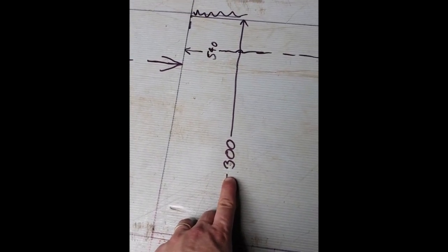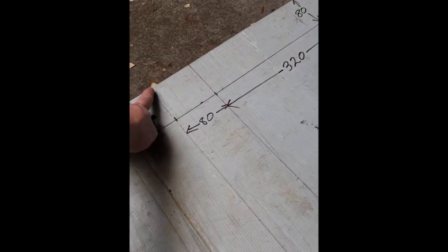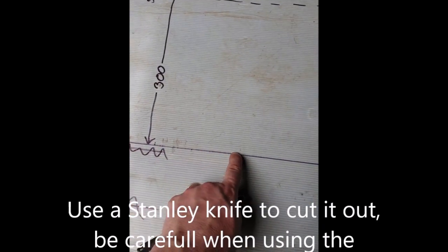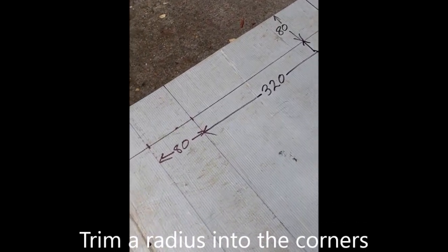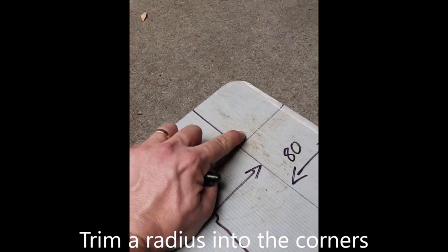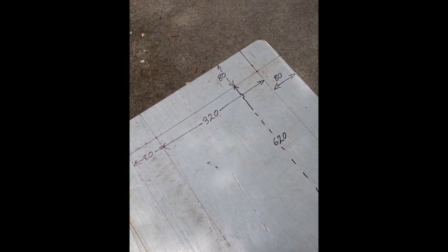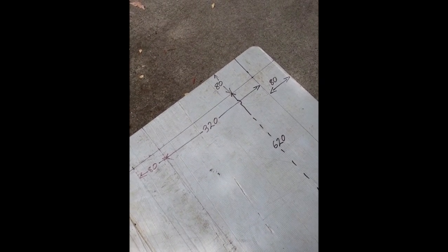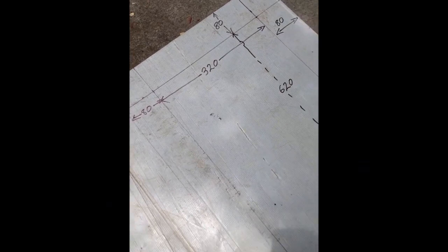The tail piece is also a tiny bit narrower at 300mm wide — that's so after you've made the folds along these lines, the inside piece has clearance to fold up inside it neatly, so just give it about 10mm each side. Once you've got it all marked out, cut around the perimeter of the entire thing, then make a small slip into the fold lines to allow that flap to fold up and tuck in. I just put a little dollop of Loctite on there and went over the top with a bit of gaffer tape or electrical tape — whatever you've got. The Loctite will hold it once it's gone off; the tape just holds it together while the glue is curing. G-clamps with a bit of timber each side will also work.